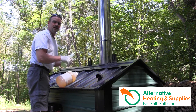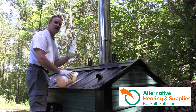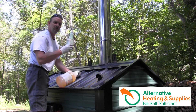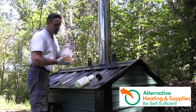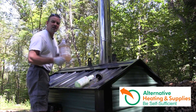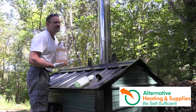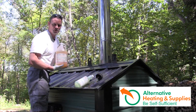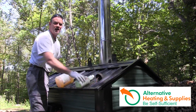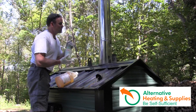Now we know it's as clean as we're going to get it. There are two products we use: A200, which is a nitrate-based product that is environmentally very friendly but a little more expensive, and Protec 300, which is a nitrite-based product that most manufacturers use — a little more aggressive on scale and rust inhibition, a little harder on the environment but not that bad. It's a sodium-based product. Our customer has decided to use A200, which treats up to 200 gallons — this unit has 120 — so no problem.